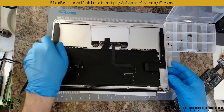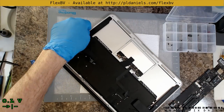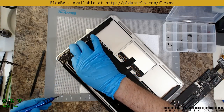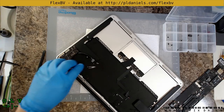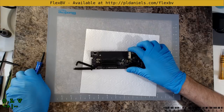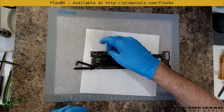Alright, let's get this board out and have a look. Oh, more rice. Oh yeah, there we go — the rice really got into this one. Looks like the fan picked up the whole lot. What I still don't get is none of the liquid damage markers have gone off. And I see corrosion on that connector — holy dooly, I see lots of corrosion on that connector.